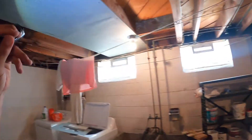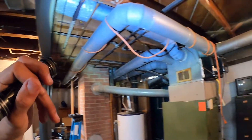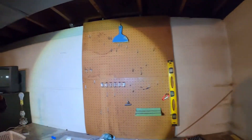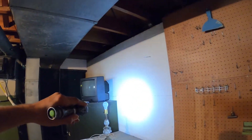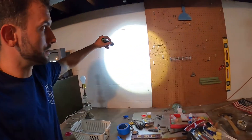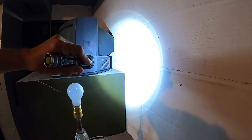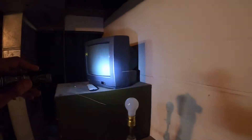Overhead, looking at the floor joists, sub-flooring, and steel support columns, everything appears to be intact and the home is structurally solid and sound — except for one item. Along the right side wall, as you look at the house from the street, I can start to see just a little bit of horizontal cracking running across this wall. I already put a level on it and it's relatively plumb. What happens is consistently wet soil adheres to the wall, freezes, expands, lifts the wall slightly, cracks it, then thaws and settles back down, leaving behind this crack.